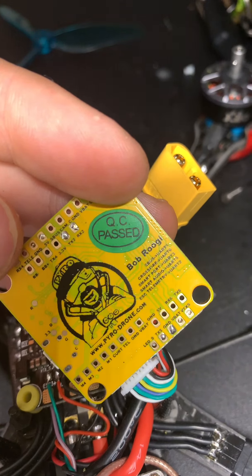If I measure the voltage on these two pins - 16.8V - that's coming through. The flight controller was working for the USB connection, but as soon as I plug this harness in, that's when it stopped working.